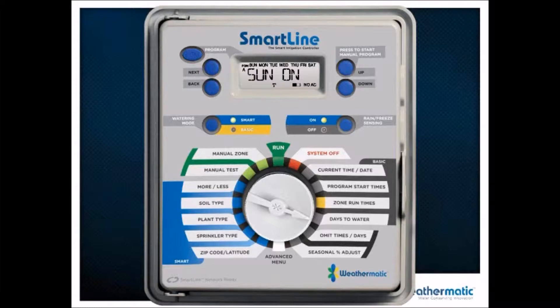If you are using weather-based control on each zone, then the 25-minute default for zone one, for example, would be overridden by whatever the ET value was for that particular day. It's important to note that you need at least one minute of run time on each zone even when using ET — this allows manual zone irrigation and also provides backup functionality in case you lose your weather station and can't water according to ET.